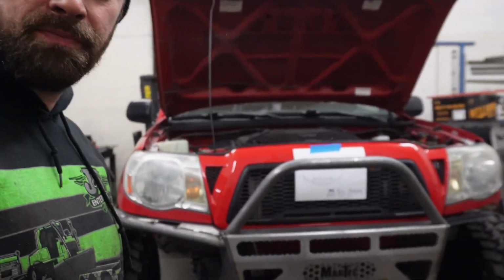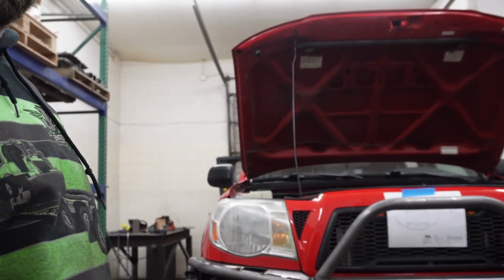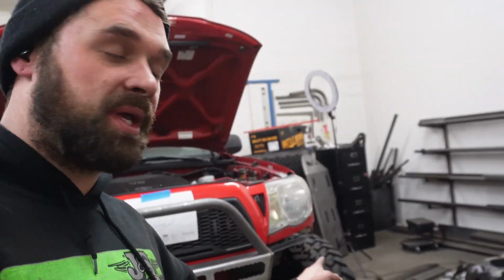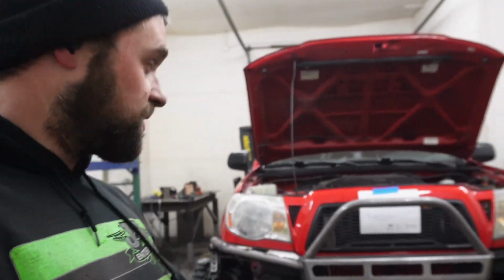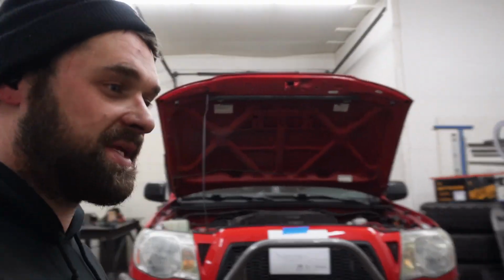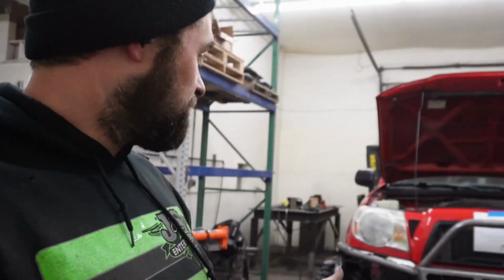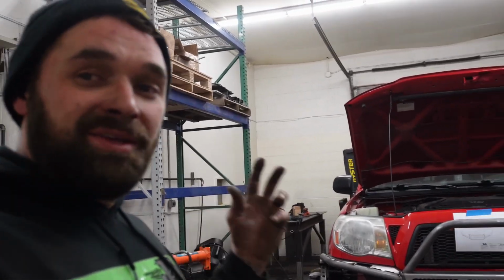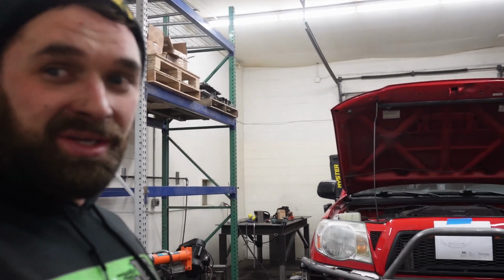It's looking good. So we got the main hoop on, started putting the outer wing on. I think tomorrow when I come in, I will do the other wing, do the upright tubes, and then do the corner tubes that come off of the stinger down. And then from there, I just gotta pull it off, cap the ends of the tubes, finish weld it, and do the worst part of the whole thing, which is get it ready for powder coat.